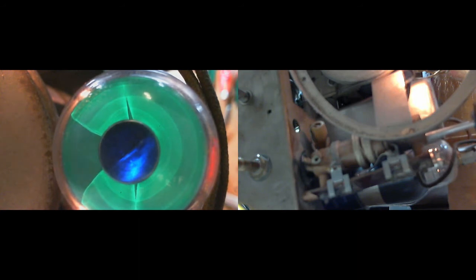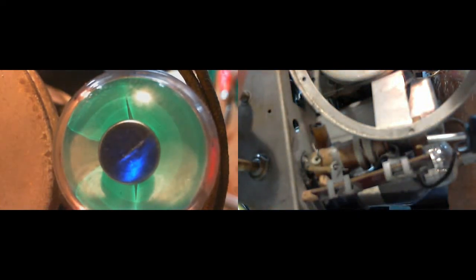But maybe it's just moved. So let's go hunting. I'll leave the screwdriver in there. Just lay it down here. There we go. Now I'm going to tune the radio. And we'll see if we can... see, it seems to be here now. So I'll peak it. Right there. Pull the screwdriver out. And see now if there's an even higher peak somewhere. So what's that telling? It's really indicating that it's something to do with those coils.